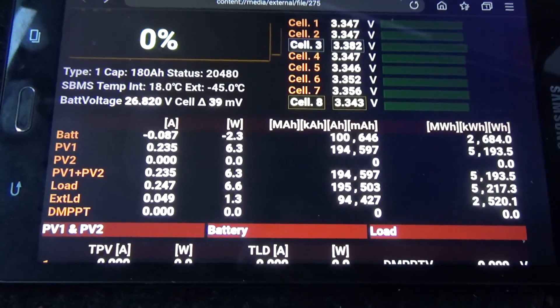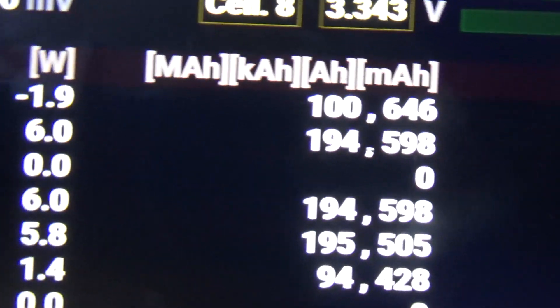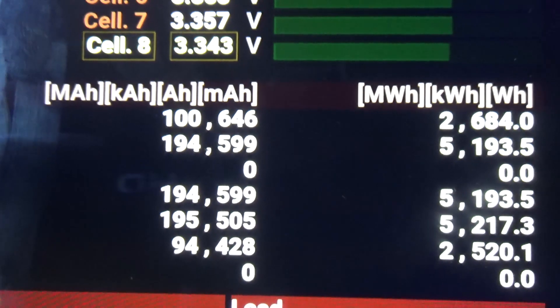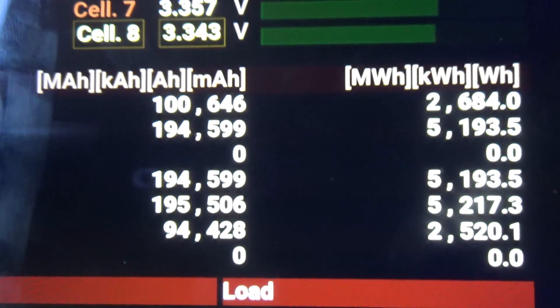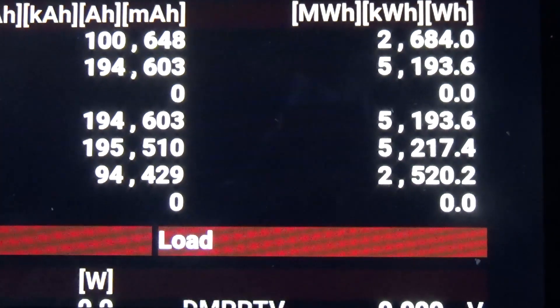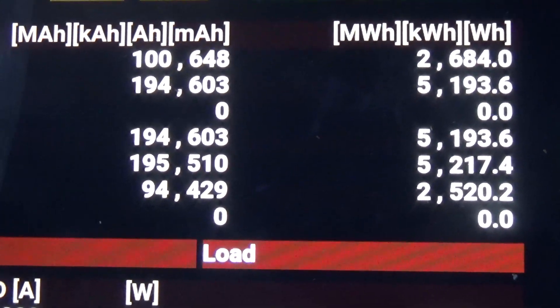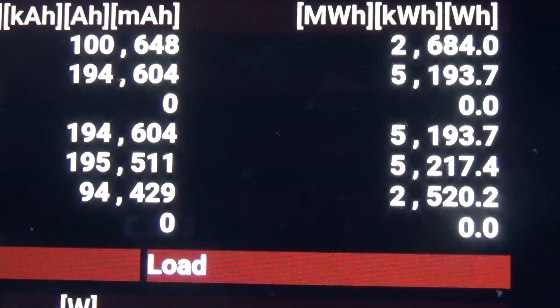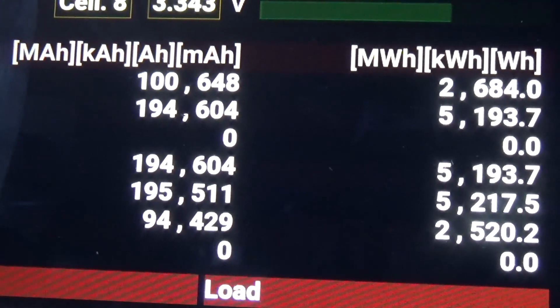The two key figures here are the two top lines — that is the battery and the panels one. After seven days, the top line is the battery, which is actually the MPPT charge controller, and the bottom line is the DSSR20s direct to battery.